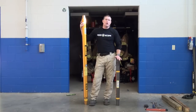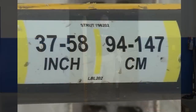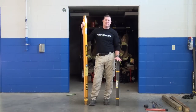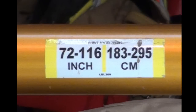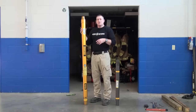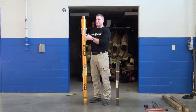On the grays, they're all marked in inches. You can clearly see that this strut in particular is a 37-to-58-inch strut. There are some variables with that length depending on what types of base plates are applied, but that's our general length throw — 37 to 58 inches. On the golds, we also have inch markings — 72 to 116 — and one of the added features of the golds are additional general nomenclature markings such as '610.' There are also 305s and 406s, and those all denote basic foot markings. So the 610 strut is a six-foot strut that extends all the way out to ten feet.